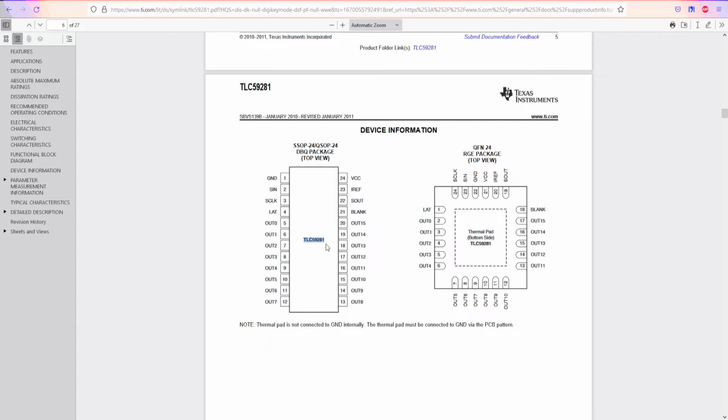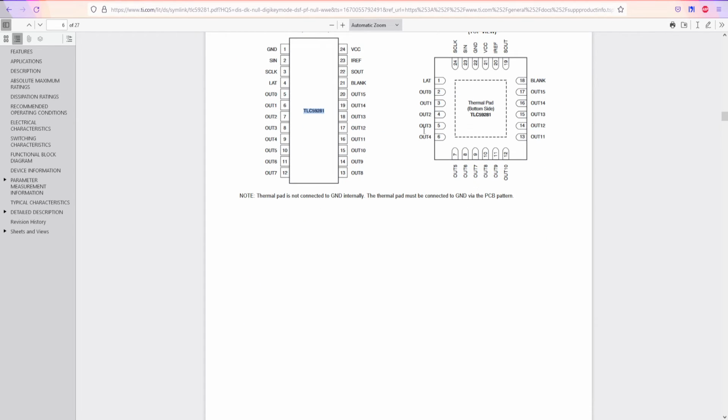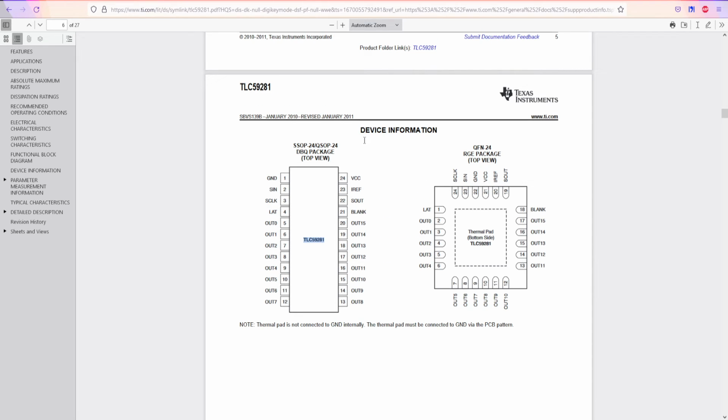If you have a component similar to this and some of the pins don't work out, you can copy the library or the library's script of a similar package, make a duplicate, and modify it to your needs if it has the same distance. I had this problem like 10 years ago when I needed to do something with KiCad or Eagle, when it was free of charge and wasn't Autodesk software. But in any case, we're going to use the tools which are available today, easy to use, easy to understand, and probably one of these components may be used in future videos.